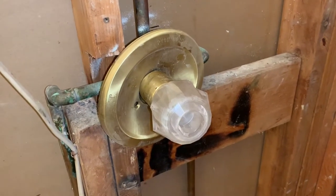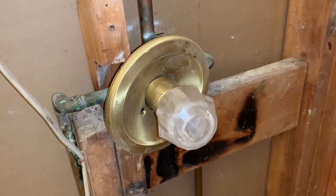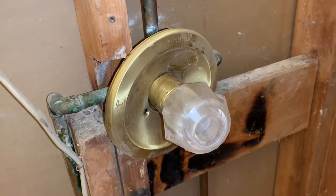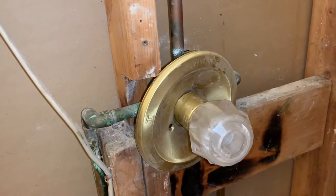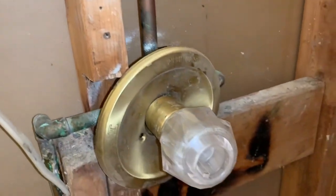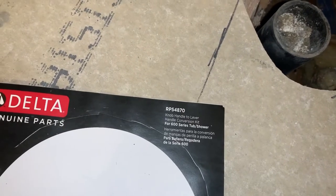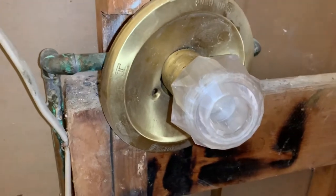Hello YouTube, I'm doing a bathroom remodel and as part of this remodel I decided to replace our old knob-type Delta 600 series with the new lever type without really having to change the whole thing. For that you can use Delta RP54870 — it's a conversion kit that comes with the knob and everything else you need to convert your old knob type to the new lever type.